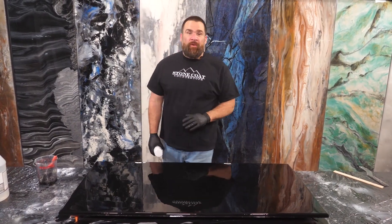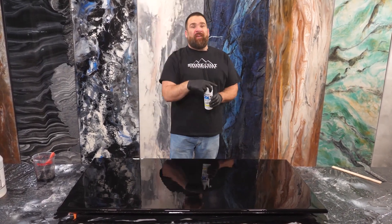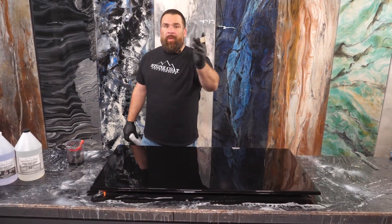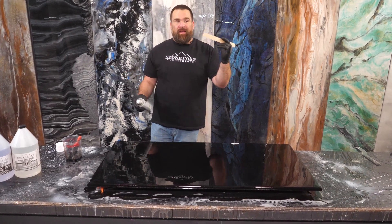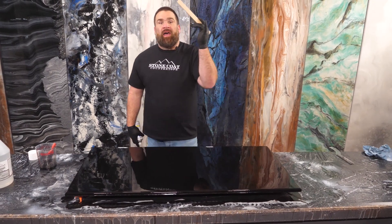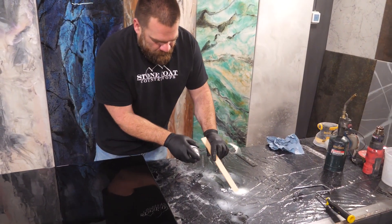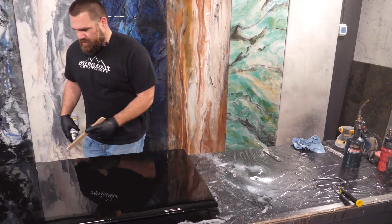The air has been removed out of that black epoxy. Let's add some contrasting veins using white Rust-Oleum spray paint. To do this, we're gonna spray the tip of a paint stick — no high-tech tools needed. Spray off your project and then just drag where you want that white contrast vein. Give it a good spray and we're gonna drag.